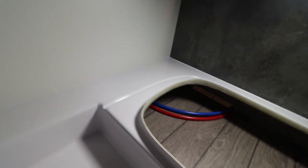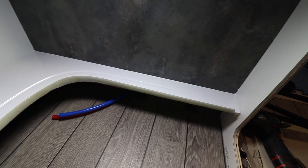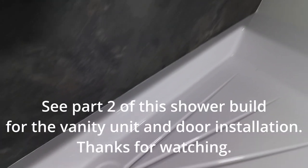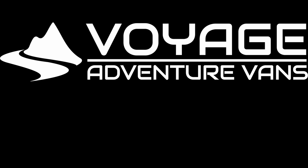The white Sikaflex goes a little bit yellow over time, so I wouldn't want to rely on it as a bathroom seal. But otherwise I'm quite happy with this. I'll clean it up and leave a decent seal all the way round, to then be finished off with a fat three or four mil bead of silicone so that we've got decent coverage. That shower tray is going nowhere.